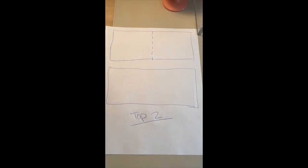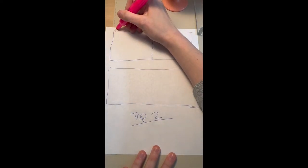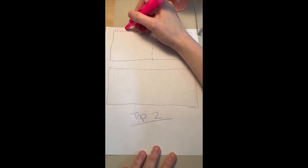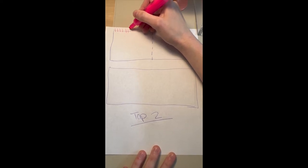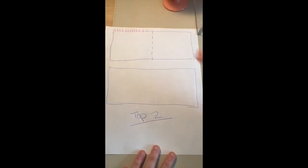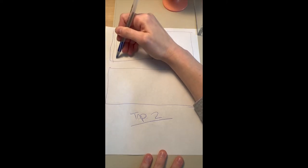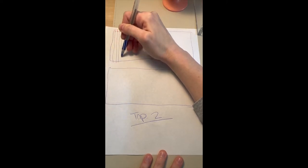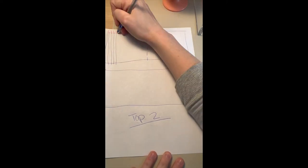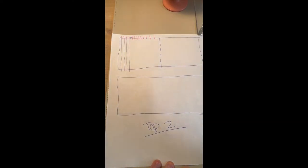You want to find your middle point and draw a line down your dresser. Then I take my trim pieces and evenly space them out until I get to that middle point of the drawer. Once you figure out the number of trim pieces that go across to that middle point, you can start figuring out your pattern. I always start from one side — I knew at the top I wanted it to be straight, flowing into the second drawer. I had four pieces and then made a gap out of one of the spaces and one trim piece for my handles.